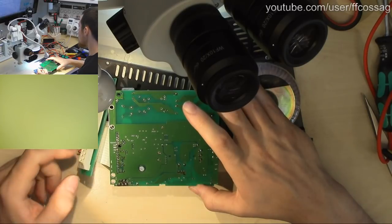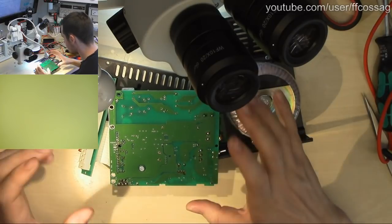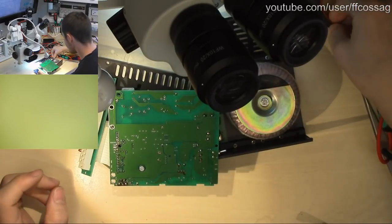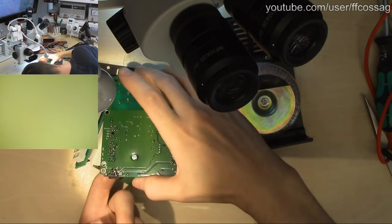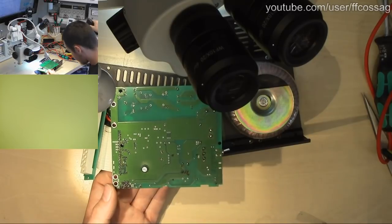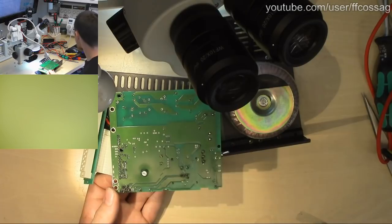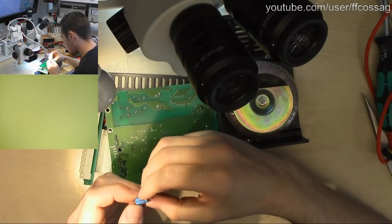Someone says, couldn't it be something on the bus that's drawing too much current? Yes, it could be, but I have not been out to the station to troubleshoot this. They just gave me this box and said, this thing's broken, fix it, and I'm going to fix it until there's nothing left to fix. There's probably some kind of loading test in the near future. But right now I want to check specifically a Philips branded capacitor that's right there. The techs working on these windmills tend to be pretty good at diagnosing this stuff, so I have some confidence.